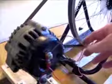And it's from the stator that you get electricity, now induced electricity, coming out of this post. Now, the problem with alternators is that you have to have power in order to generate power. As these alternators are in your car, when you turn the switch on your car, it is connected to a battery. So we have a 12-volt battery pack here. It's nothing large, just some AAs put in series to generate 12 volts. When you turn the car on, power is directed from the battery to the alternator through the post connections, as well as these voltage regulator and field sensing wires that come off of your alternator.